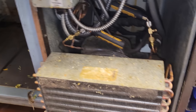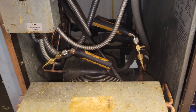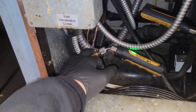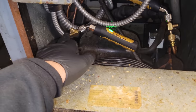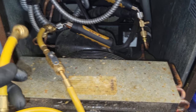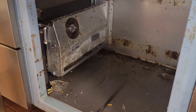I love using the Job Link probes, but one downside without a traditional manifold is that I want to equalize out my pressures. My low side has pressure because the solenoid valves are sitting at 20 PSI, and because the solenoid valves are closed, it's not equalizing out. If I had a manifold gauge set, I could just open the high and low side valves and it would equalize. But there's another way — I keep access fittings on both, so I'll just put a hose between the two, let the pressures equalize out, and then we'll do a leak search on the system. I leave it cracked so it's slightly hissing out, so we're constantly purging and not introducing any air into the system. Now we're equalizing out — we're at 71, 72 PSI. I have the power switch shut off so the compressor's not going to turn on.